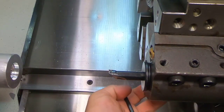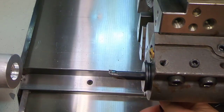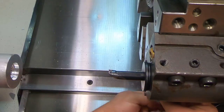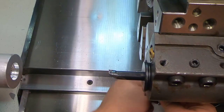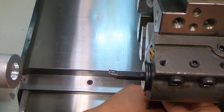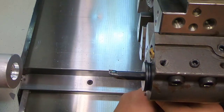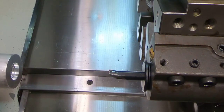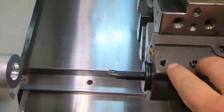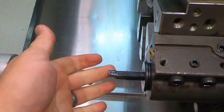Now, normally whenever you do this, I have another set screw right here. If it gives us too much trouble we'll skip it, but usually in manufacturing you want to have as many set screws as you can on the boring bars you're using, because you need that rigidity whenever you're cutting. Once we get it all tight — there it is, nice and tight. We've got a lot of rigidity on this boring bar; I have two set screws on the bottom side holding it, so that is very rigid. Be careful when you're messing with this because it is sharp.